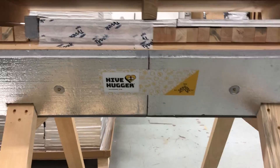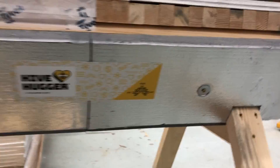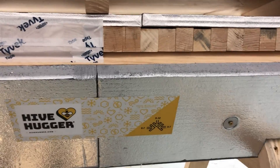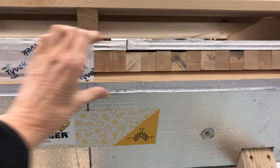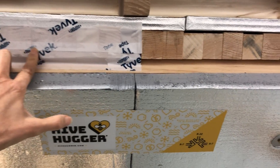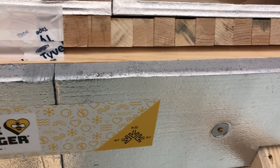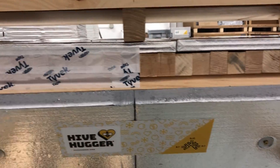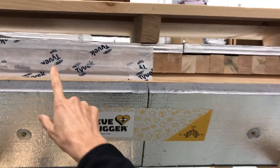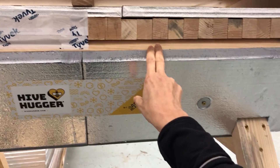The only place we need to address potential heat loss would be this aspect here. It's kind of challenging to try to fit another piece of foam there. But if we use Tyvek tape applied like this, it would at least provide heat loss prevention. It wouldn't really provide a lot of insulation, but you've got these big R32 panels on top. I only taped half of it with the Tyvek so you can see what it looks like without that.